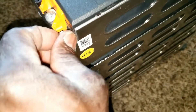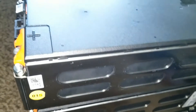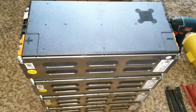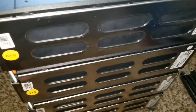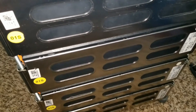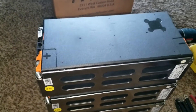Nice bank right here. All the positives on one side and all the negatives on the other for 12 volts. I think it's 108 amp hours — supposed to be 111. So one module is about 108Ah at standard test conditions. If you're talking about four of them: one-oh-eight times four.